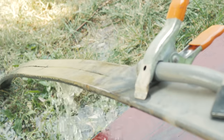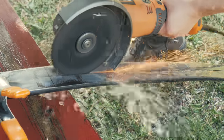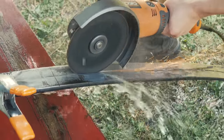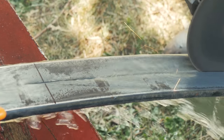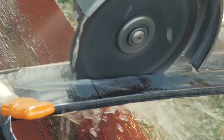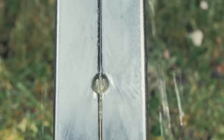At the very least it led me to learn something very cool that I'll be taking through my whole building career — the poor man's water cooling setup. Who would have thought you could multiply your quality of life 50 or 100 times with a couple of spring clamps and a garden hose? Having taken these springs out of a truck, they're already hardened and tempered, so you don't want them to get hot or you could ruin the temper. But if you keep them cool while cutting you can avoid that whole mess — the steel doesn't even get warm. It's so nice to just make your cut straight through without stopping every 15-20 seconds to dunk your steel in a kiddie pool.